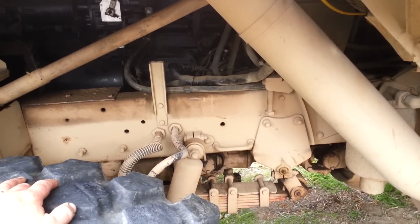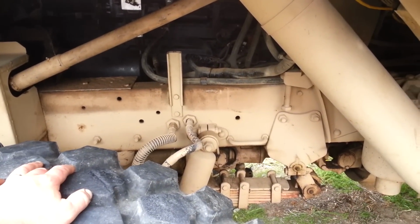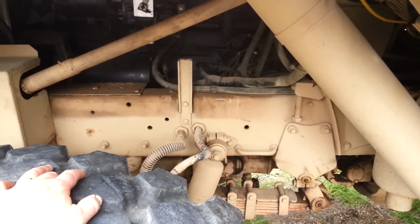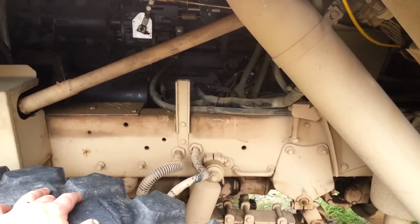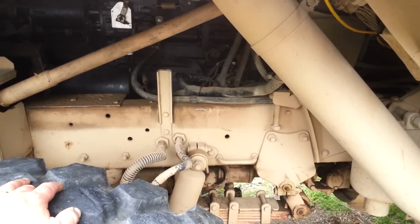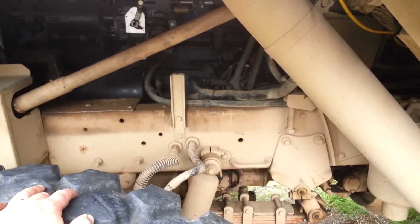The bearing comes out of that, looks fine. None of the other ones show any sign of anything. I'm not sure. It's not magnetic, and it doesn't have copper attached to it. It's brittle rather than soft, which leads me to believe it's aluminum, not Babbitt, though I'm not entirely sure.